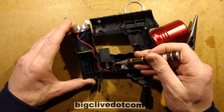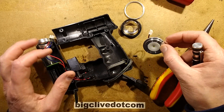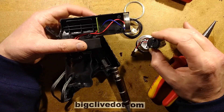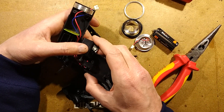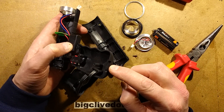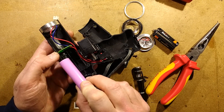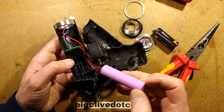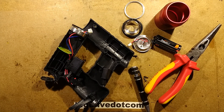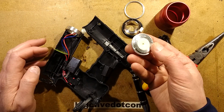And it has a micro switch, a battery contact, the plug going out to the LED, and then the LED with no current limiting at all. Well, that's not much of a surprise, is it? So what can I say? It uses triple As, which is disappointing — they're not going to last a huge amount of time, but it does open the possibility of using rechargeable nickel metal hydride ones. It would have been nice if it were fully rechargeable. I notice at the bottom this little plate comes out, suggesting it may have been designed to have a charging port in the bottom — maybe they had a plan to do a lithium battery version. It's not far off; they may have had the plan to put an 18650 in the back of it. So that's inside the Rolson Z5 Focus Spotlight — it's really just three triple As, a micro switch, a battery contact, and the LED, and that's it, with quite a complicated assembly.